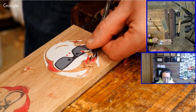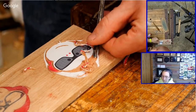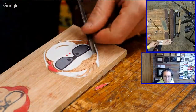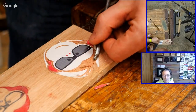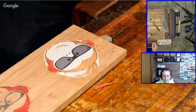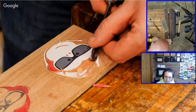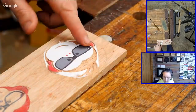Wood By Wright — how to sharpen a V-tool — use that in the search and you'll come up with that video. The bottom of this is going to be uneven, and that's not a problem because the epoxy I'm using is opaque. If it were a problem, I could put this on its side and use the straight edge of the V-tool to pare out the bottom and clean it all out. But I don't have to worry about that because we're going to be filling this with epoxy.